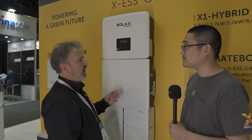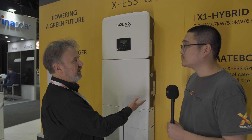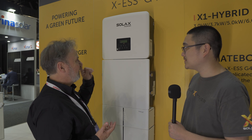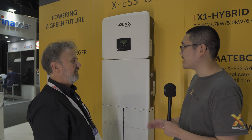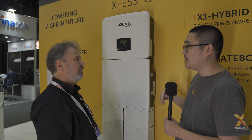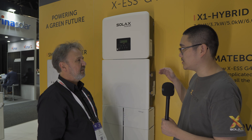The advantage of oversizing your solar is that you can charge a battery and supply the load with AC power. Correct. Because the rebates encourage lots of solar — people love cheap energy and you're supplying it directly and storing it at the same time. Even with extra panels, when the PV panels are generating extra power, we will use that extra power to charge the batteries.